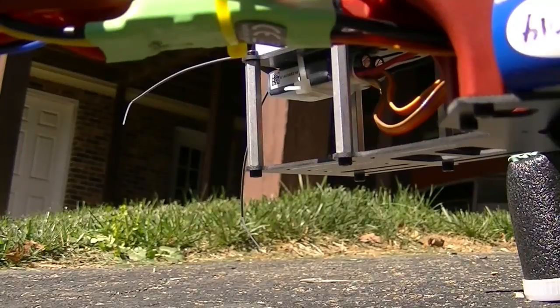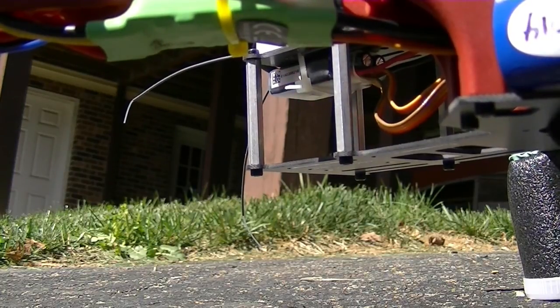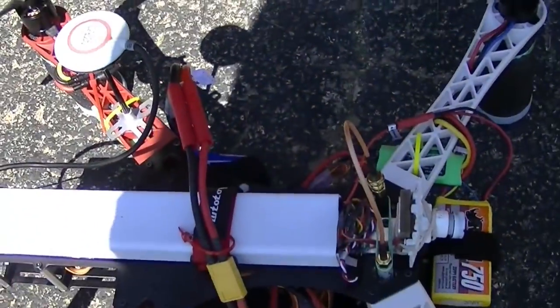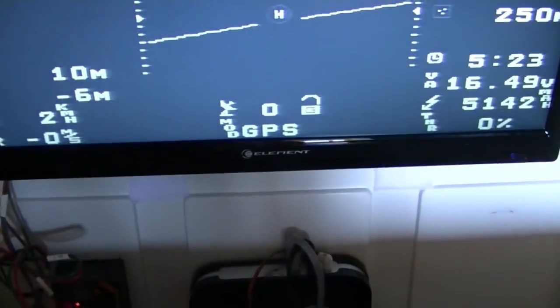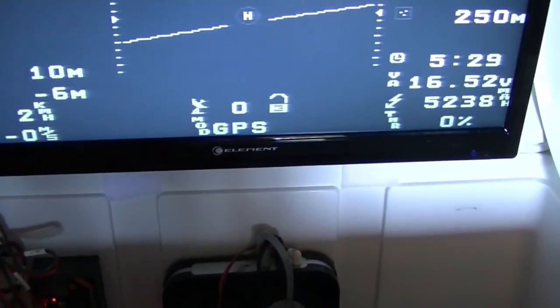Maybe 400 milliwatts is the right amount. Now let's switch to 1258 - going up to channel D. I still have the solid green light and I'm switching to 1258. When you switch frequencies apparently the GPS loses signal for a little bit and has to regain it. Let's check inside - remember, this is without the bandpass filter, all I have is the low-pass RF filter. No satellites at this point on 1258.